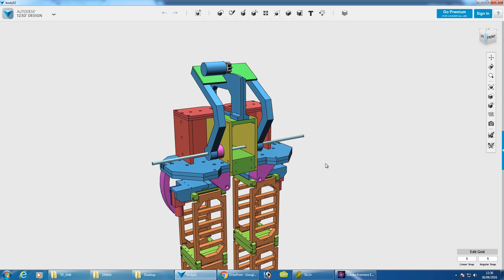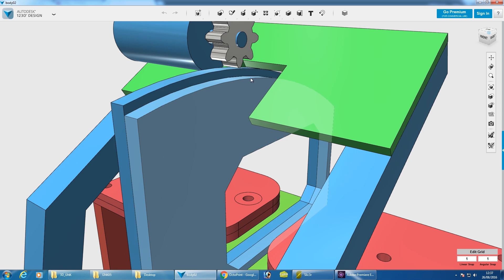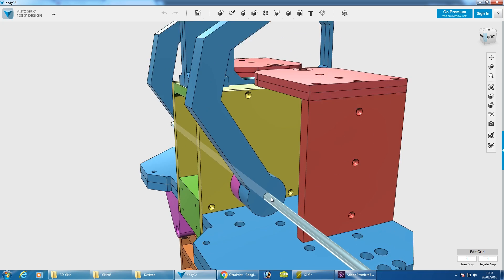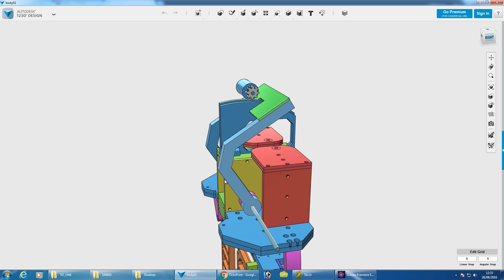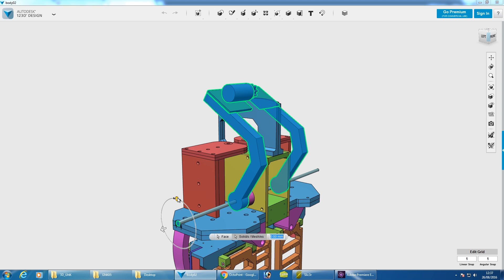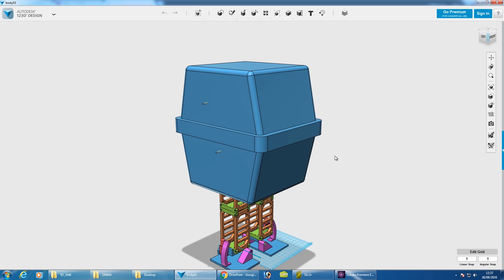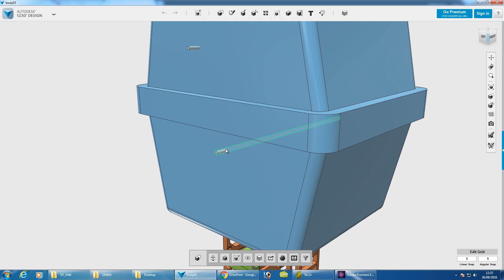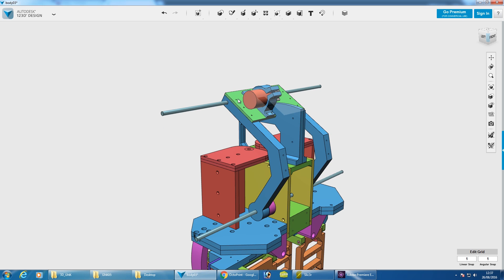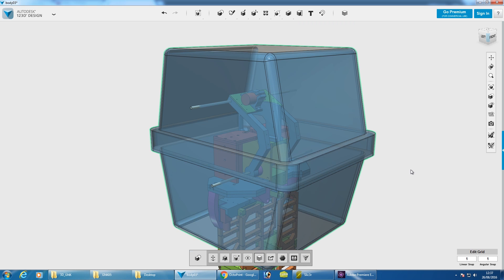I've designed a pivot mechanism which uses another motor to drive the body backwards and forwards. On top there'll be a tooth track, and a motor that sits on a green plate pivoted around the waist point, so the whole thing will pivot backwards and forwards. We can use smart rotate to see how that works — that's the sort of action we get. The simplest approach is to run the pivot point all the way through into the box with a reinforced area there and another at the top, attached to the top of the frame.